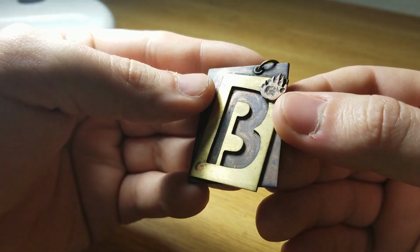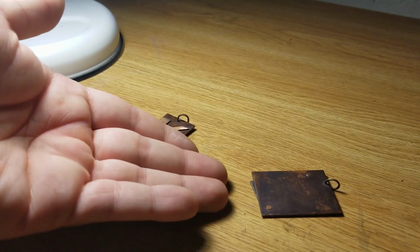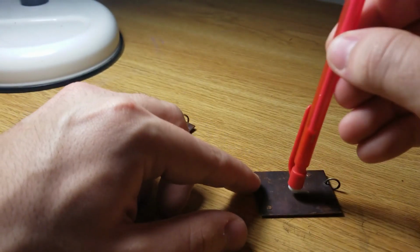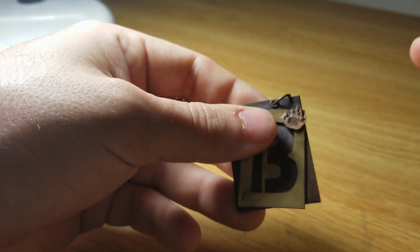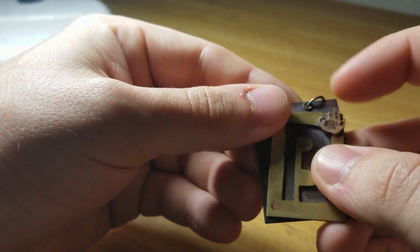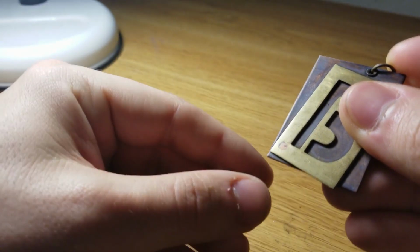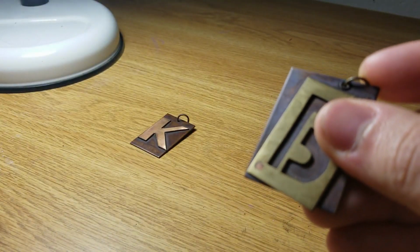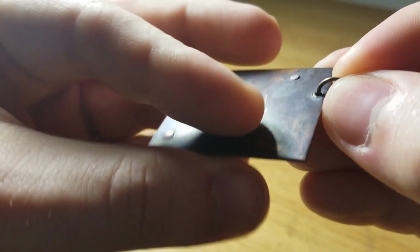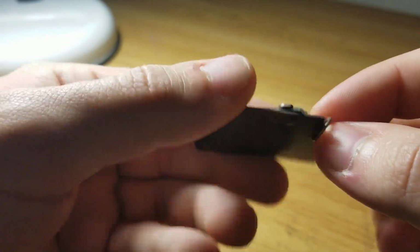and then on this little bear paw. So the bear paw was called a decorative rivet, where you take a sheet of copper and you solder a copper wire to the back of it, having this little thing come off it. Then you snip it real close, and then you drill a hole in the metal, you put it through, and then you hammer it flat on the other side to widen the wire so it stays in place. I did that here as well on this corner. I wanted to make a flush rivet where you flatten it out into a hole that's tapered so that it widens but also stays flat. I didn't really care about the back. And then this is a tube rivet going around the hole for the ring, where it's a brass tube. You push it through the hole and then you hammer it wide with a ball peen hammer so that it opens from the inside out instead of collapsing on itself.